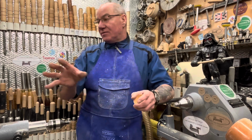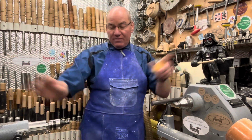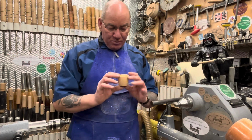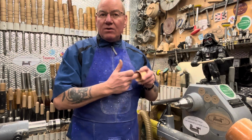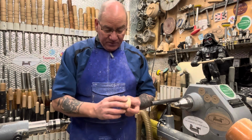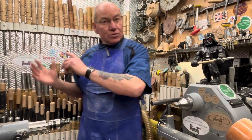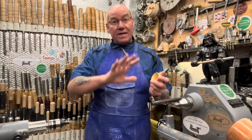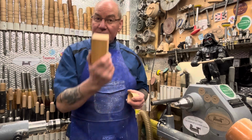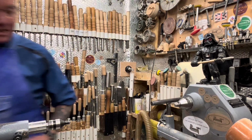By the end of this, and there's only a couple more videos to go, you're going to be able to do everything. Right, so we're going to do a little pot. This is all about getting the nice finish here, and also here, because the benefit of doing an end grain one is, if you were using traditional tools, you could be using a skew on the outside to get a beautiful finish. Well, we can do that with our square carbide, and that's what we're going to do today.